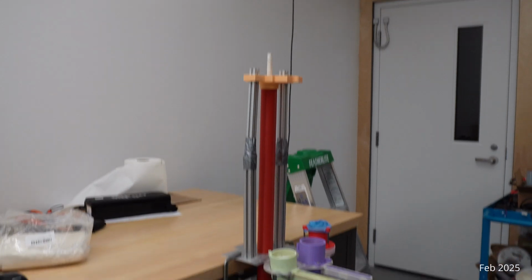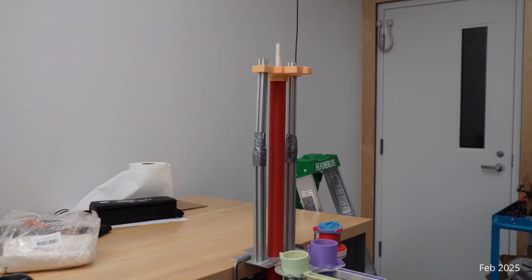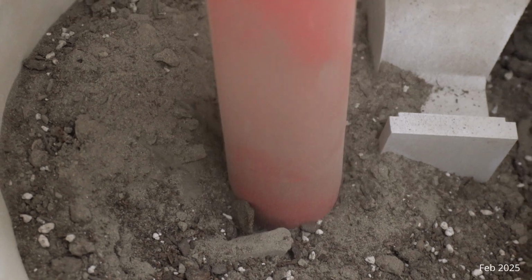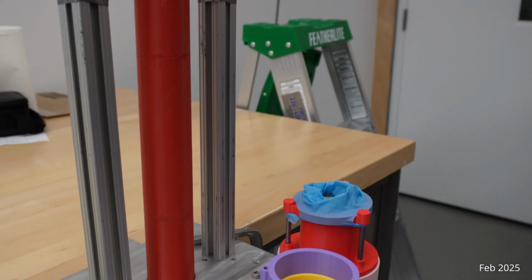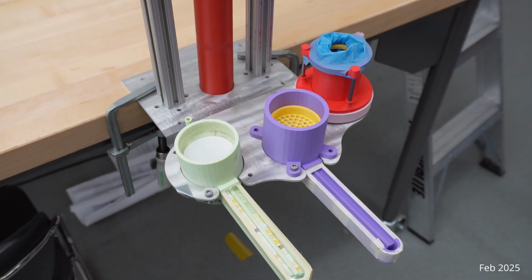This system has been greatly improved over last year by developing an auger system rather than relying on the arm to scoop soil, allowing us to have accurate readings of what depth we're getting the soil from and to dig deeper. We've added probes to the center of the auger, which can test for temperature and moisture at a depth. We've also made modifications to the testing system and improved the caching apparatus.